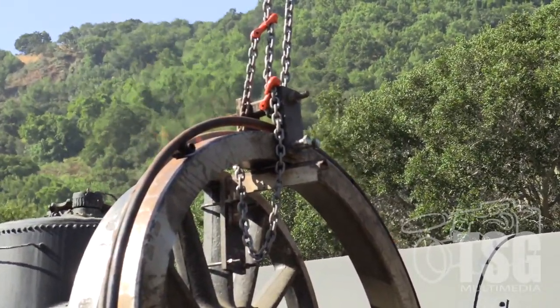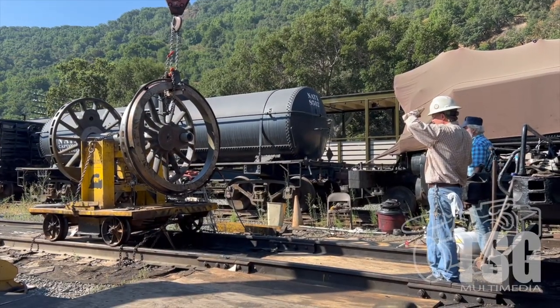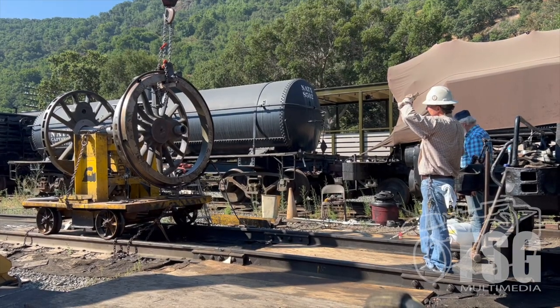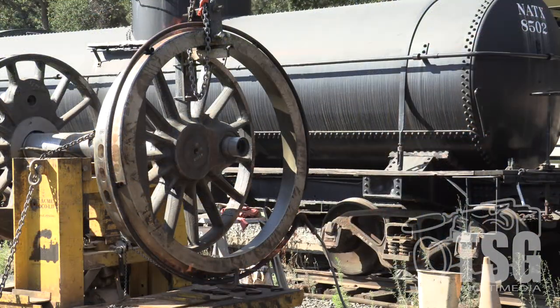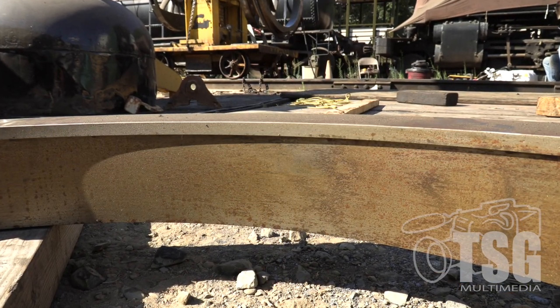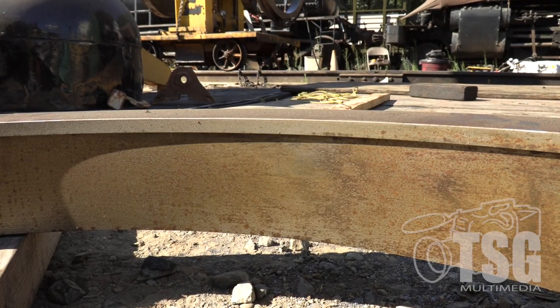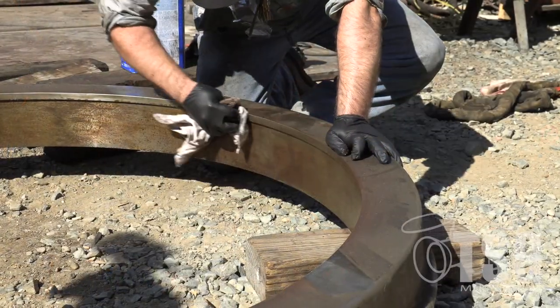Each one of these tires was machined to fit on a specific wheel center, and we tried to get the diameters mostly the same. There's an index — a small cut in the wheel — and the dimension between those two indexes is key. Each tire has a different number there, and that's what sets our gauge once everything is tight on the wheel.